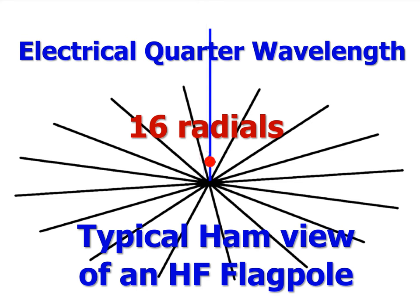Though as recent research has shown, only 16 radials are needed at HF. Radials at MF, for an AM broadcast station, only improve soil conduction. But in the ground at HF, much of the field still exists, and the RF currents easily return to the vertical half of the antenna via only 16 radials.